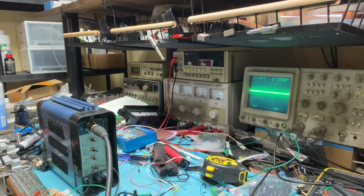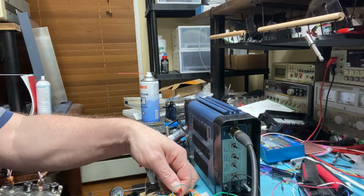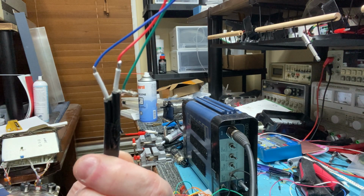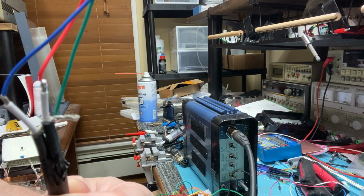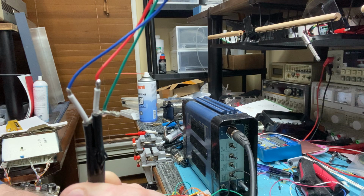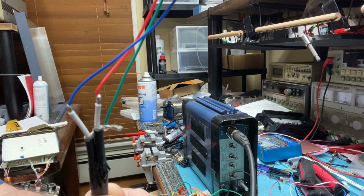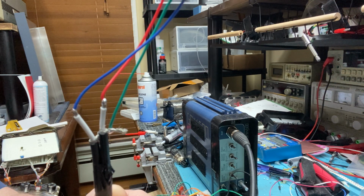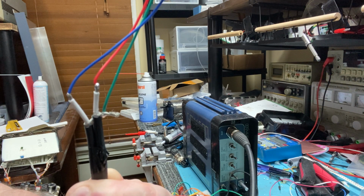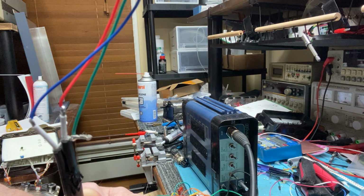You can make these up yourself, very easy. The one thing which I suggest that you do, which I'll just pop this out really quickly because I know where it goes, is the cable. I've used two basically inert, as in you wave this over the detector coil and it doesn't sound off, because it's made out of very, very fine strands of tinned copper wire. And I say tinned on purpose, very fine on purpose. If they're thick copper strands, it will sound off, especially if they're over about 0.2 millimeters. Depends on the clocking rate and stuff too, and there's a heap of factors to take into account.